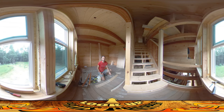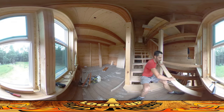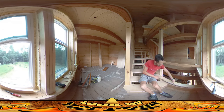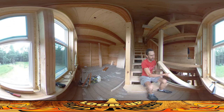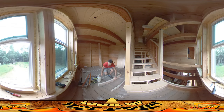None of this stuff goes particularly quickly at this point because I'm being kind of meticulous about everything that's going in. Like this piece here is the bottom where the balusters are going to go into, and this right behind you is where it goes. It's going to set right down here — it's pretty snug so I'm not going to put it in right now. I've got this kind of tapered edge that stops right around where the stair ends. I've just been meticulous, getting everything smooth and sanded, and it takes more time doing it that way.